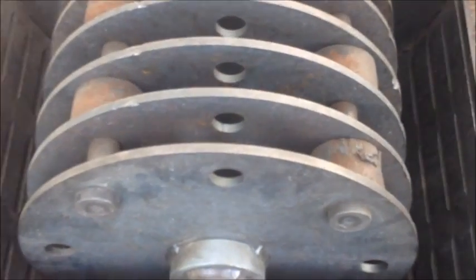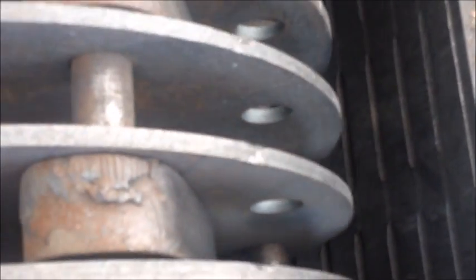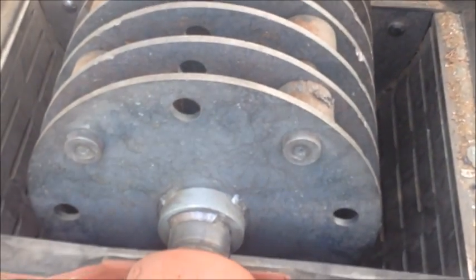Here's a look at the inside of the hammer mill. You can see the screen down below. They're 1/2 inch by 3.5 inch slots, so the boards have to grind up small enough to get down through those slots. Here's the rotor assembly and the hammers